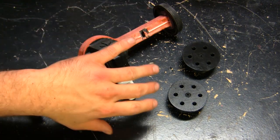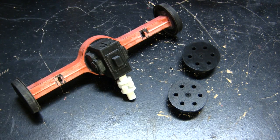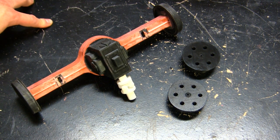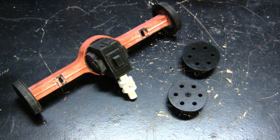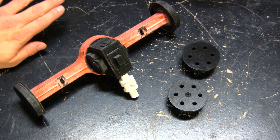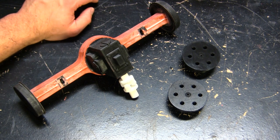Once the drill and tapping was concluded, I went ahead and thoroughly washed these two sections here, as well as the two end sections, with some mineral spirits, as well as denatured alcohol. The purpose for that is to thoroughly wash off as much of the WD-40 residue as possible. Because these units are going to go into paint, that material on the surface of these sections here is not going to be very beneficial when it comes time to add the layers of paint. So you want to get as much, if not all of it, off as possible.